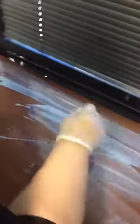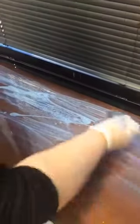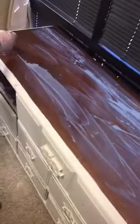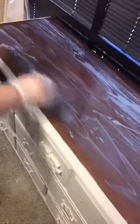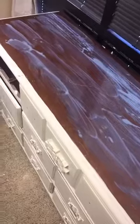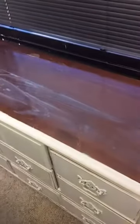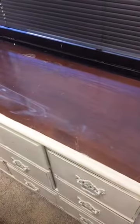This is supposed to be see-through so it's gonna be really light for our first coat. The brush just gets it everywhere, then we're gonna smooth it out with the stain pad. Use the side that doesn't have the little sewn edge - that's my favorite side. We're going to smooth it out, which looks like we're removing a bunch of it, but you do want it smooth. And you can see just a little hint of gray. Back and forth. We're not worried about the painted area because we can paint over the stain top.